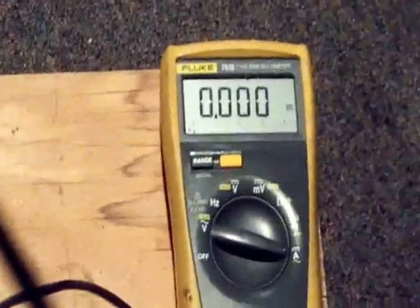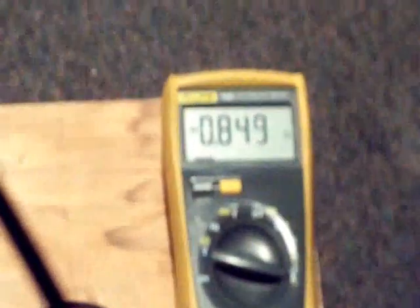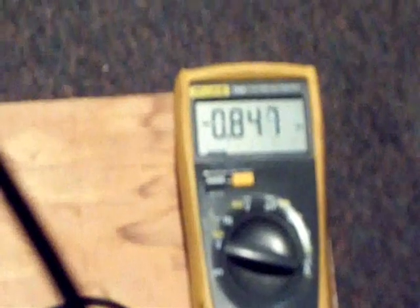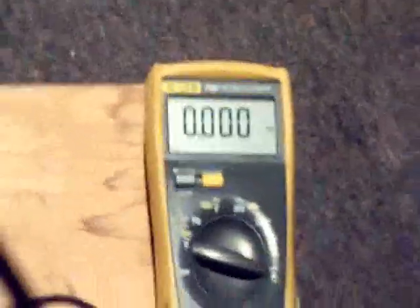What I have here is a current meter on my alternator setup. An alternator needs an energizer circuit, and that's what this switch is here for. When I turn that on, the alternator begins using current — you can see it's negative 0.8 amps, which is draining the battery. So what I do is get myself spinning first. Since there's no resistance yet it's not taxing me much, and once I get spinning I can then turn my switch on.